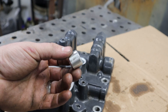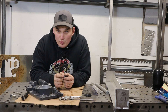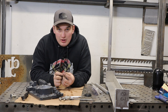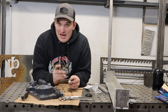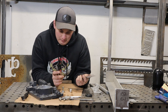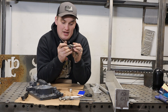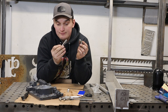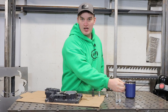We've got this nice little slug all machined out to go down into here — it just starts in there, which is perfect. But there's just one little hiccup. Remember that thing I was telling you earlier about double-checking everything yourself? Well, I just broke my own rule. The tap that the customer bought and provided was a 14mm by 1.5 pitch, and I did not double-check that it matched our banjo bolt — and it doesn't. So I've got to go track down the right tap.